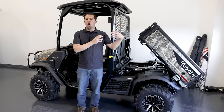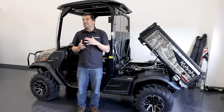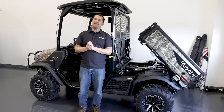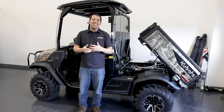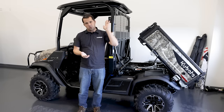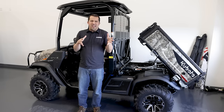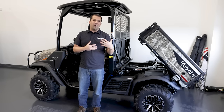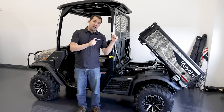That comes along with some quirks. When it comes to capacities and towing, you're going to find this machine very capable and very underrated. You won't have any trouble finding people who are very surprised by the work they can get done with it. But it does mean it's not a blast-around type utility vehicle — it's not super sporty, it's not going to go 50 miles an hour. It is made to work; it's effectively a tractor. Because it has a hydrostatic transmission, when your foot is on the gas you go, and when you take your foot off the gas you stop — the machine coasts to a stop very quickly. That gives you great control going up and down hills, but it does throw people a little if they've come from a CVT transmission. Definitely worth a test drive if you're considering one.